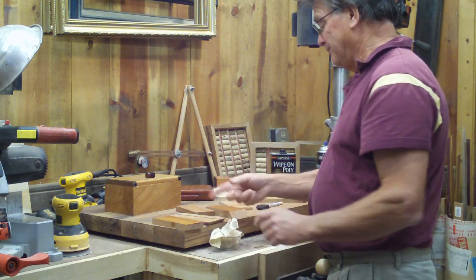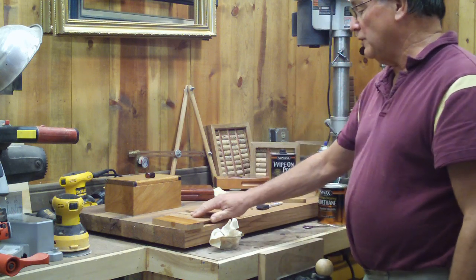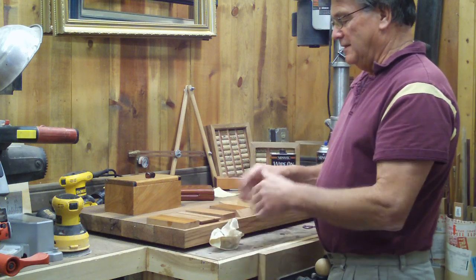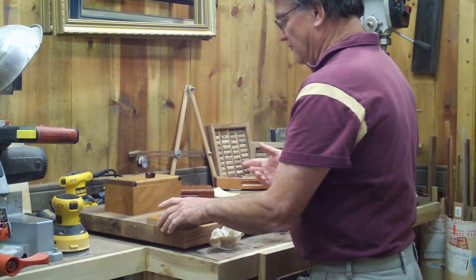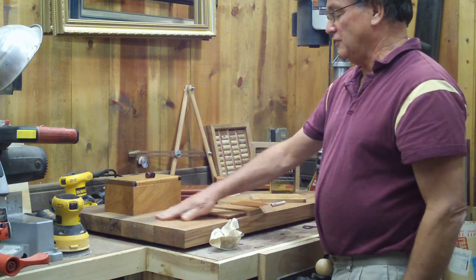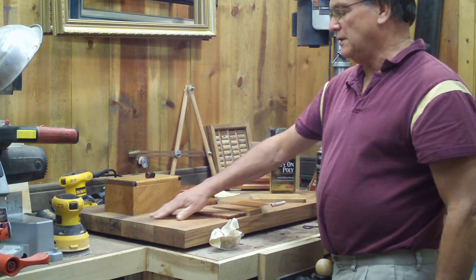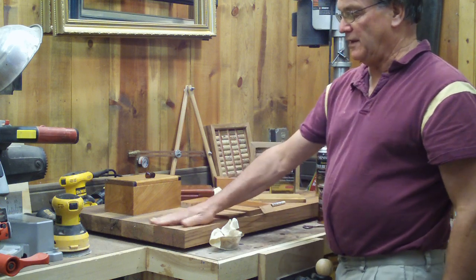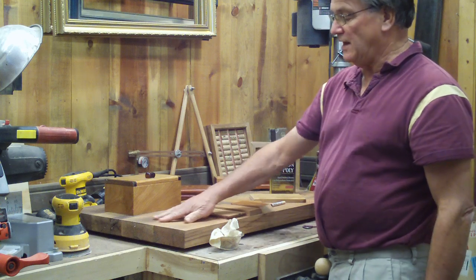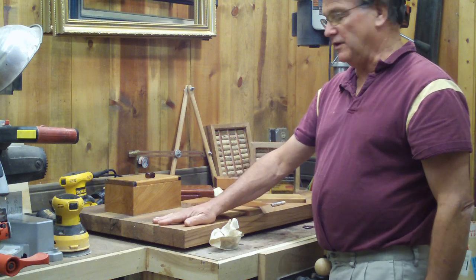So you can see, if you put five coats on, how much time you're getting into. That's polyurethane. I use polyurethane because I like the deep warmth look it gives you after many coats. This old tabletop you see here is actually just two coats of tung oil. You can keep putting tung oil on and you'll end up with a semi-gloss finish, or you can stop now, sand it down a little bit, and put polyurethane or anything else you want on.